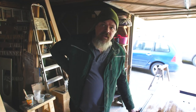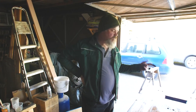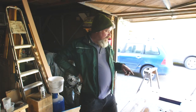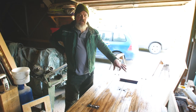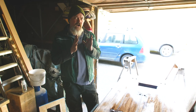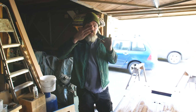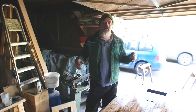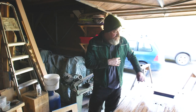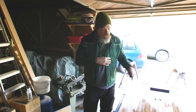So, we're leaving it there for today. Once you do these things, you end up with this aperture, we have to go through a refinishing process. That's gone in really nicely. We were going to make a metal sleeve for that, but we cut our hole so fine that the metal sleeve that went around it would essentially interfere with the opening of the gate. And we weren't going to remachine that and make another template and remachine it to gain 2 or 3 mil. So what we've done is put a nice routed detail around there, and I think it works really well, actually.